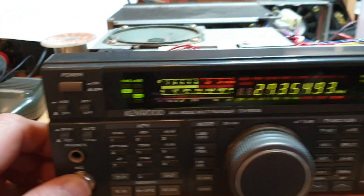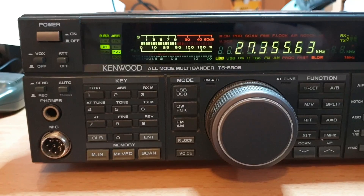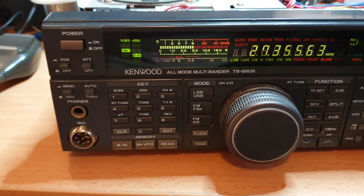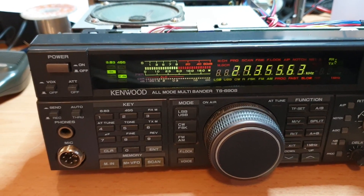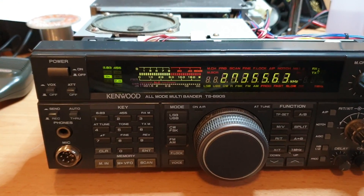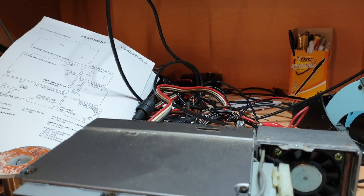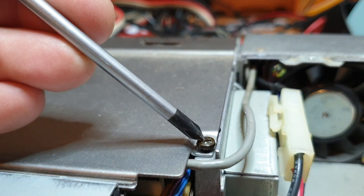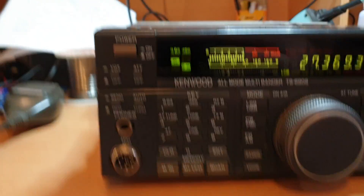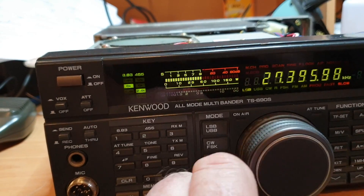It's amazing — it didn't work and now it does work. Looking through the camera, if I just drop my head, the display's actually not looking too bad. The camera's picking up better than my eyes maybe. To the message that came through: yes, one single diode will do it. Also notice something — look at the distance between the screw and where it is, this has been out by somebody before us. We're off to the PA at some stage once we've got this S-meter thing sorted out. See how that goes down when I come back on the signal but it doesn't go back up — that'll be an adjustment, I guarantee it. The VOX issue too — this one has a number of issues.